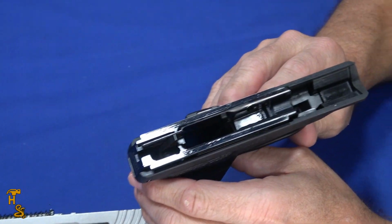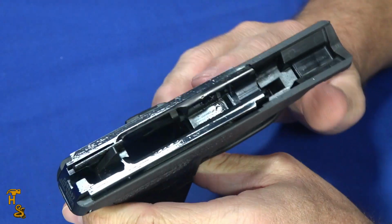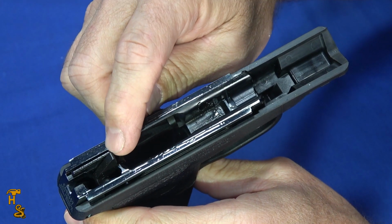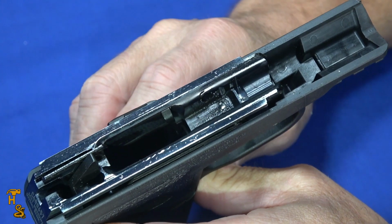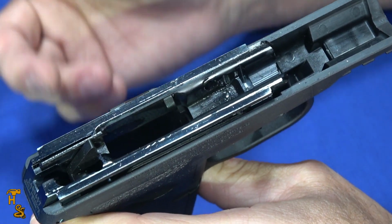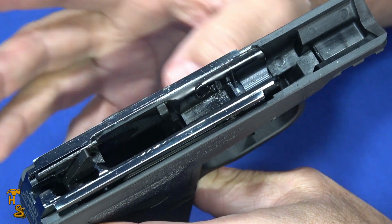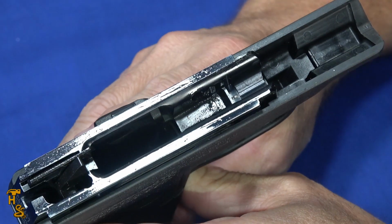They're bone simple. They've got very long, robust rails, very full-length rails. Here's the hammer at the back, and there's really nothing else going on in here. You pull the trigger, it pulls the hammer back. When it reaches full extension, it automatically releases and fires. So there's no pre-cocking or anything you can do with these. It's actually quite a very simple operating mechanism.